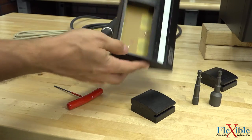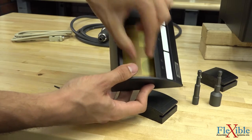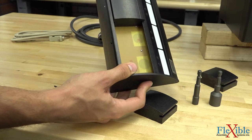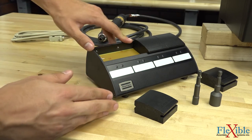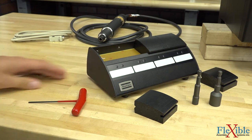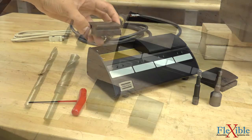Now the socket selector works by using this weight plate at the bottom. When it recognizes that you've removed the socket from the tray, you just have a different Pset on your controller associated with that specific position, so that you can switch sockets and have the controller automatically ready for the next step without you having to change anything by hand.